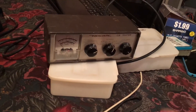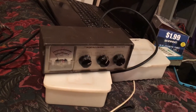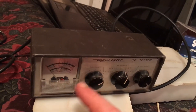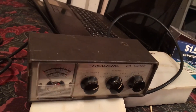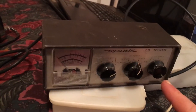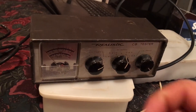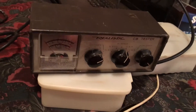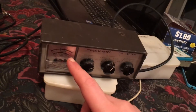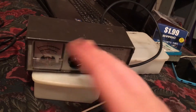If you had this on an antenna you could check channels 1, 19, and 40 to see the SWR across different parts of the band — and remember to calibrate each time you switch to a different channel. Basically it shows you the spread of your SWR. For example, on channel 1 it might be 1.1 and on channel 40 it's 2.1 — if that's the case you need to do some adjusting.